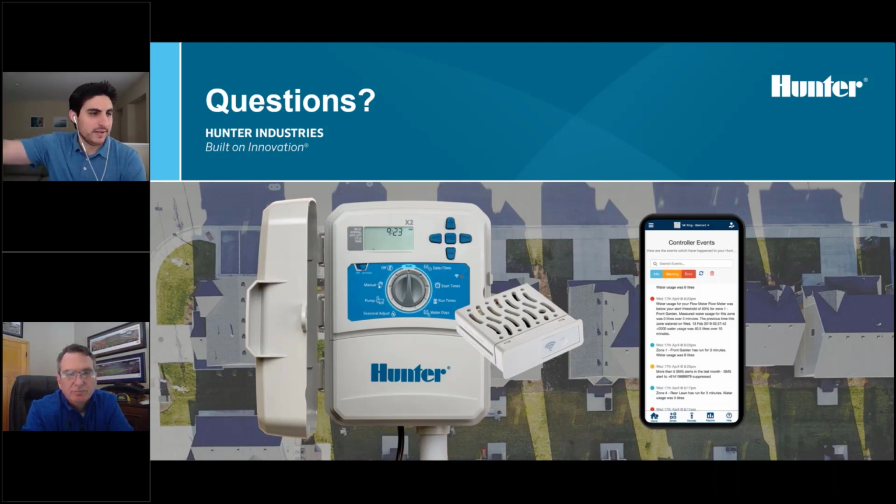You got that physical sensor out there exposed to the elements. It gets wet. It kills the circuit to the controller and prevents any irrigation. So the combination of an on-site rain sensor or freeze sensor or soil moisture sensor for that matter with the online smarts and weather data that we got is a huge benefit in terms of water saving and preventing any sort of accidental irrigation in inclement weather.